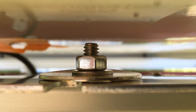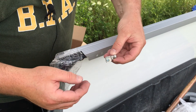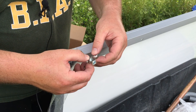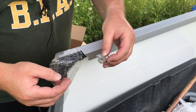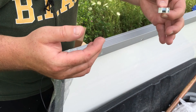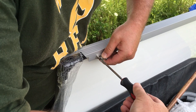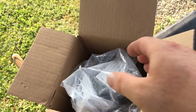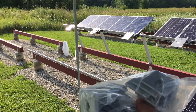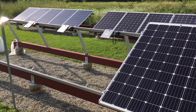I have some grounding clamps to attach to the solar panel — the number six stranded wire will attach to the grounding clamp. I'm doing this now because it's much easier at this height than climbing underneath the panels once they're racked. My solar feet just arrived via FedEx — perfect timing. I ordered them Friday night and it's Tuesday today.